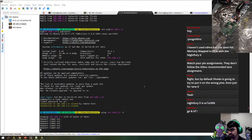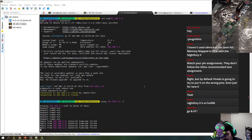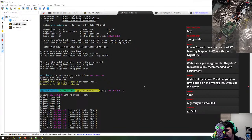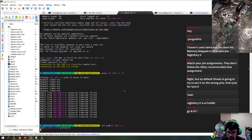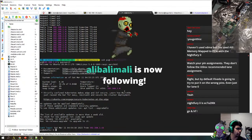Yeah, that's great. They call that tandem boot up or partial reconfiguration. It's a great way once you have a real product or a real design going. JTAG is really just for some simple prototyping and to do a recovery in case you brick your flash or something like that and the image gets corrupted. Though the issue is that sometimes you have to change the PCIe settings. So a lot of times I'll play around with a simple static image to get everything going correctly.